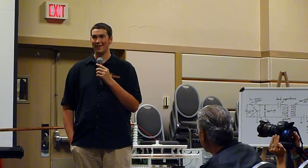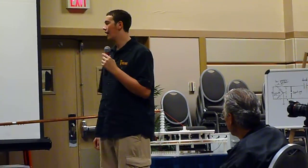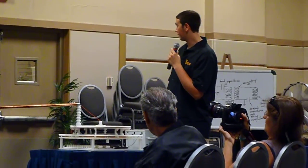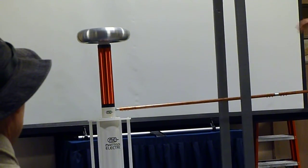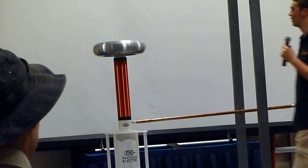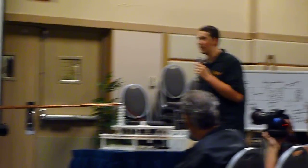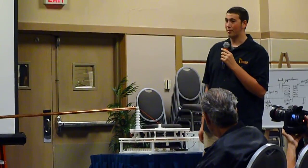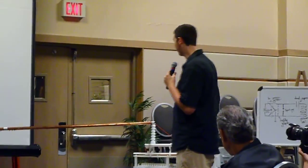That was fun, and then I told my physics teacher, and he said you've got to be careful with the radiation. Then I talked to John, and he said, nah, that's probably actually fine. But last November I said, you know what, I'm going to build a big one. So I built one — it was a two-coil system, this was a three-coil system — and I threw the switch and not much happened at all. I was devastated, but I found out that my microwave capacitors were not rated for 250 kilohertz, because I went into it having no electrical experience whatsoever. I quickly learned that you have to use components that are rated for what you're doing.